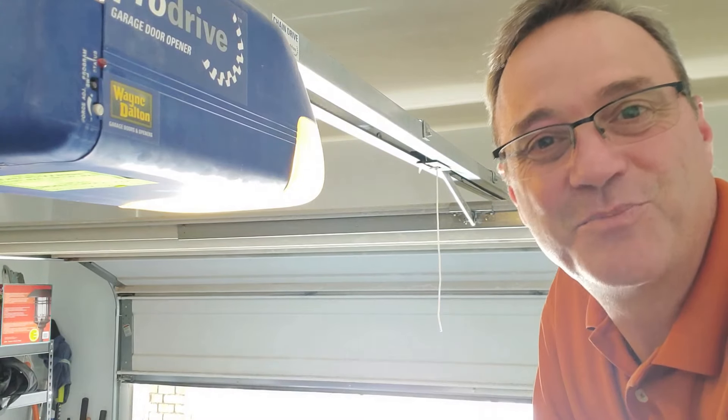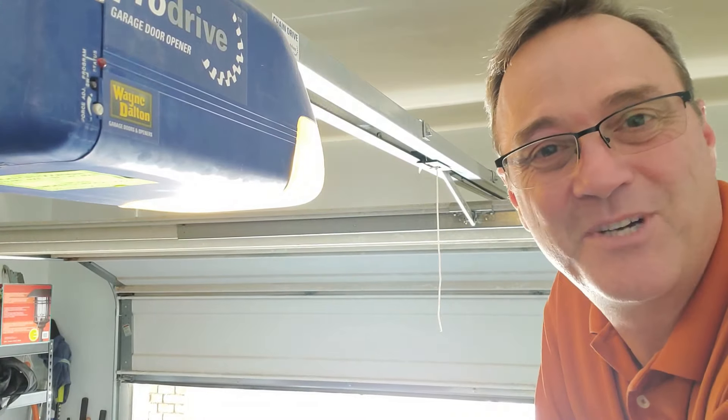The button no longer works. You can see that it's actually receiving the signal from my button, but because it's not programmed into my remote, the garage door is not functioning. To add this back into my system, you just press the button for about a second. My light comes on, which tells me it's ready. I hit the button, it's accepted programming — the light flashes to confirm — and I'm back in. That's really all there is to it. There's not a lot to clearing these out and adding the ones you have back in.